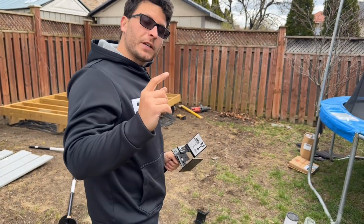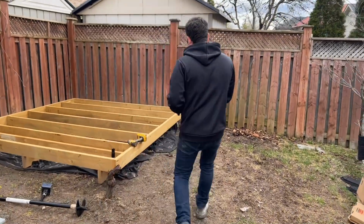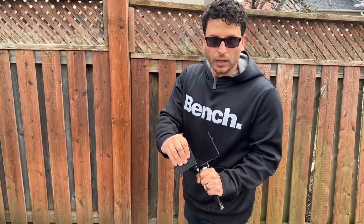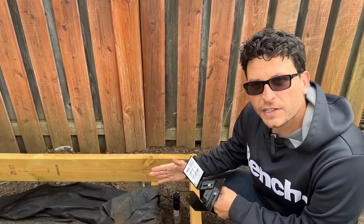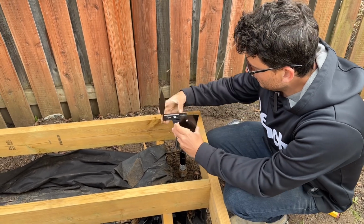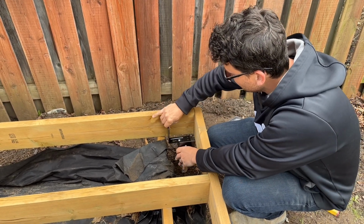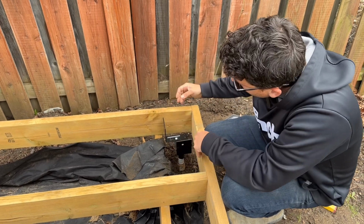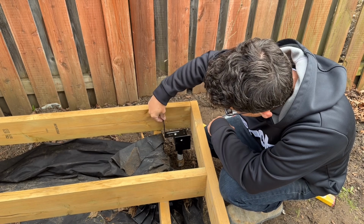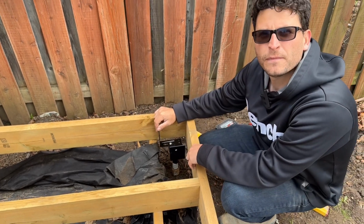Now, because we're adding a 6x6 into our corner, just to avoid the complications of having the wall of the saddle push our 6x6 out, this one, we could shape it as an L, where we come in like this, and that's where the 6x6 goes in. We lag bolt our 6x6 into the wood, and we attach it into the steel as well.